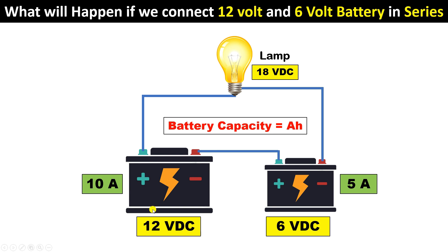If you try to flow more current in the circuit based on the current rating of the bigger battery, the comparatively smaller battery will be badly affected. So according to the bigger battery, we cannot flow high current in the circuit. If you connect two different-size batteries, you must ensure that the current in the circuit flows according to the current rating of the smaller battery — meaning a maximum of 5 amperes can flow in this circuit.